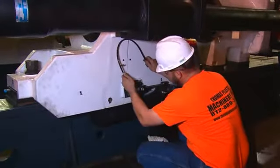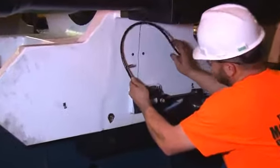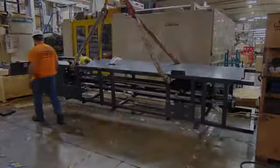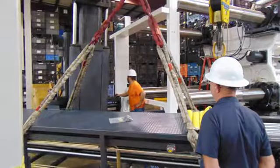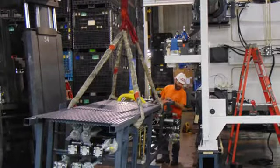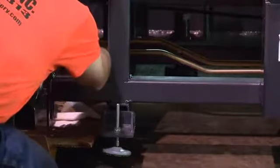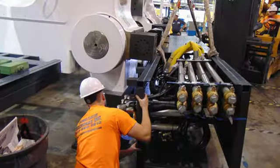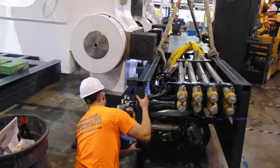Connect pneumatic line to jam bar air cylinder found on the non-operator side of the moving platen. Mount the hydraulic and water line side run to the non-operator base rail. The side run has leveling pads to ensure it is level. This unit will have hydraulic, water, electrical, pneumatic, and lubrication line connections.